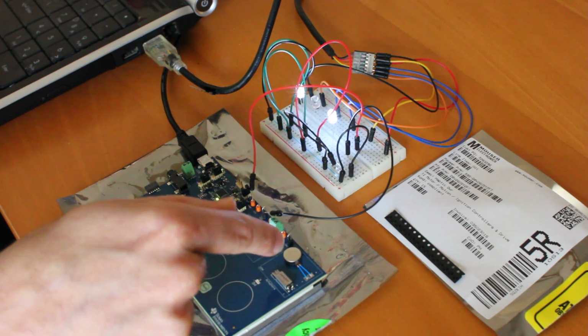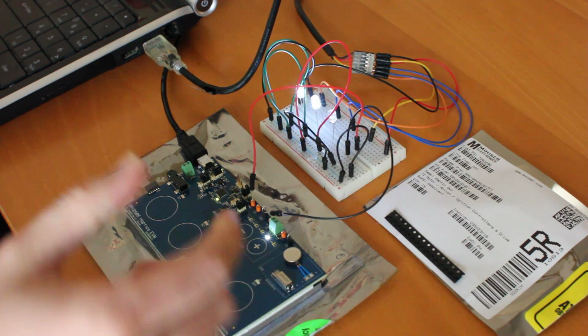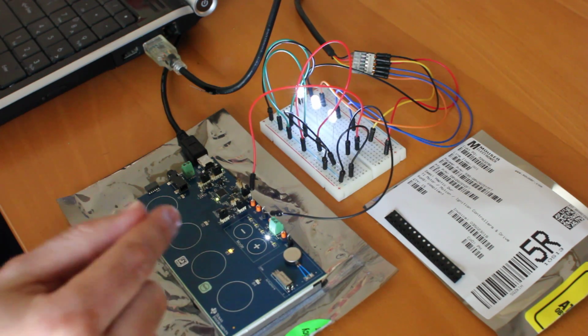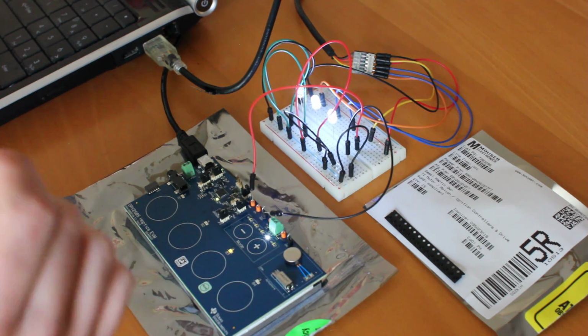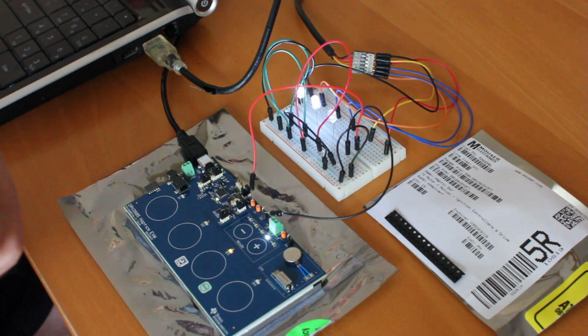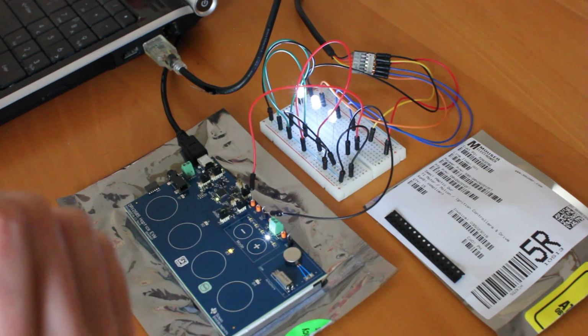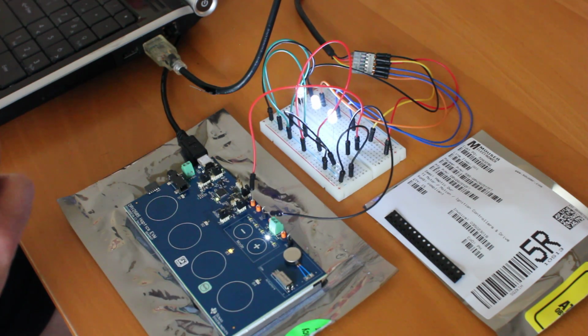These LRA motors are about $10 a pop in low quantity. So in theory, you could build a circuit board that looks kind of like this, but would have multiple of these DRV chips on it, and then you plug in multiple motors. If you wanted 6, you'd be looking at $60 in motors, another $12 in chips. So, depending on what the circuit board costs, you're potentially looking at less than $100. And that's my hope, is to sell these somewhere around there, make it worth my time.